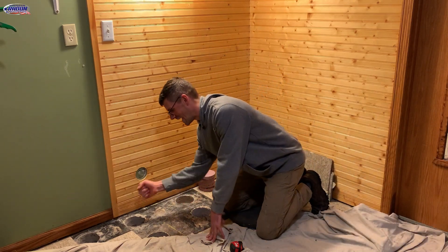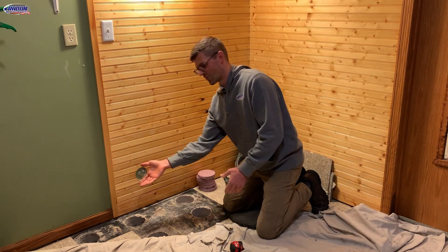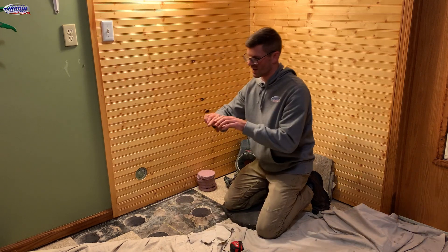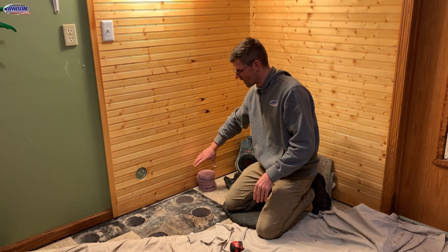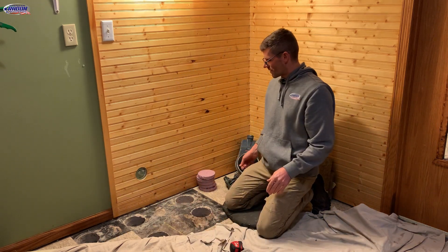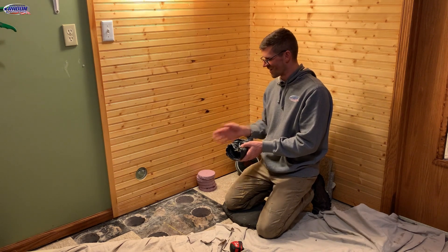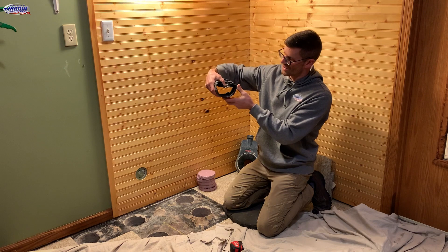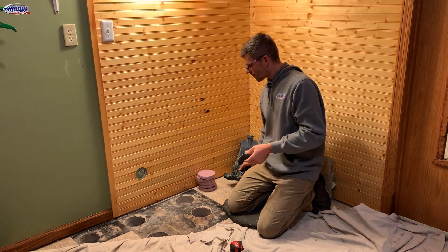I'm going to have to try to figure out how to cut a hole from the bottom of that drain tile — probably with a utility knife — and it's looking like I'm going to have to core a hole on this side, cut a hole in the bottom of that drain tile, and have a pit here so air can bypass the crushed part. With one core hole I just didn't have any leverage to cut through the bottom of the drain tile, so we ended up coring a second hole and found the drain tile still crushed, then cored another one and opened up all that drain tile. The plumbing pipe runs through here so we've got a gap about this big where we can pull air from on top of the plumbing pipe. What we found is the drain tile probably got crushed by the concrete contractor because it ran over the plumbing, putting it right near the top of the slab, and somebody squished it down — it just didn't have a very big opening and was blocking a lot of our airflow.